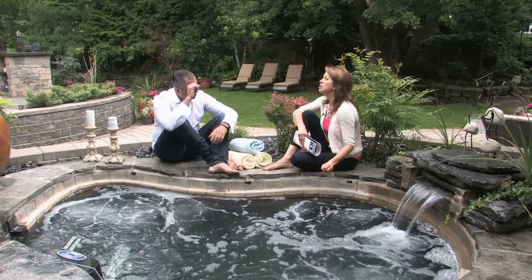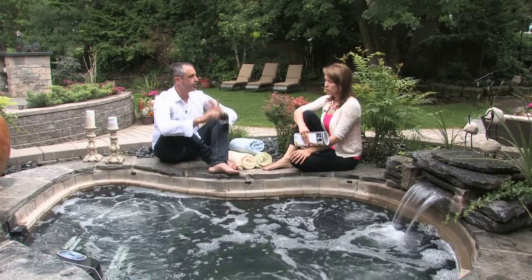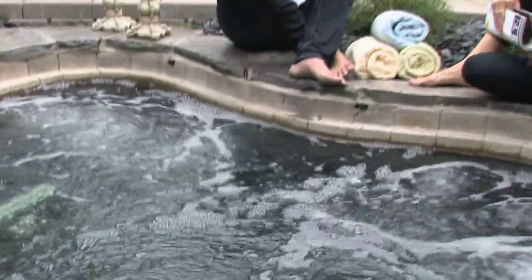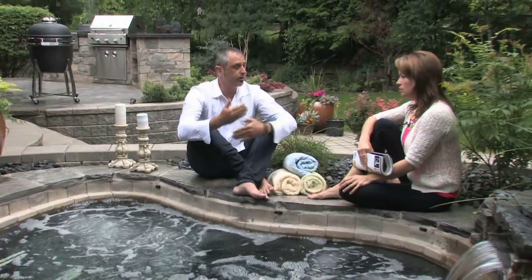Now in terms of the actual chemicals, do you use salt water, bromine, chlorine, or a combination? Chlorine or bromine, it depends on the system. Just like swimming pools, you can do saltwater systems, but you've got to be really careful. Most of the saltwater systems are built for big pools, so you really have to investigate your range of the use of salt water. In this particular case, you can go bromine, which I prefer myself. Chlorine traditionally is what people had, but there are issues with your skin, so you've got to suit it for what you're going to react to.